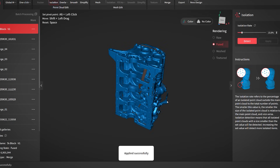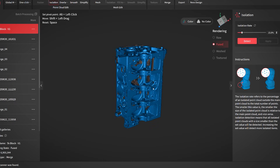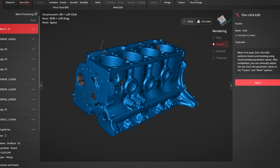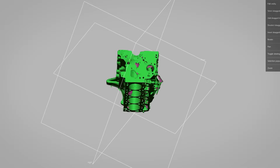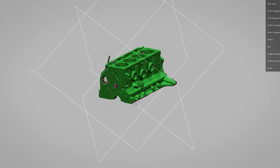I'm going to use isolation to get rid of the marker dots and outliers and just clean up the scan a bit. Then I'll just follow the feature timeline and create an export mesh for solid modelling. Now that I've got it all scanned and ready to go, I'm pretty happy with how it's looking. I think I'm ready to begin modelling, which is something that I'll do over time as I get some spare moments here and there.